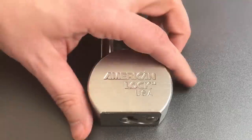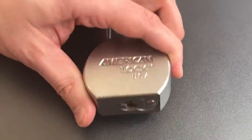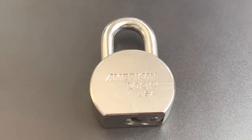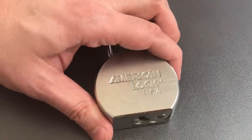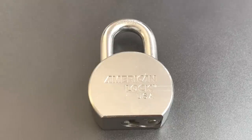The way I'm going to attack it is by exerting a pulling force on this bottom plate. I've tried that in the past with a slide hammer — I put a screw right down the keyway, attached a slide hammer, and tried to compromise this retention mechanism. Unfortunately, the only thing I managed to do was break off the screws I put into the keyway, making the lock inoperable. We're going to be trying something a little bit different today.